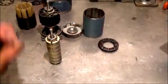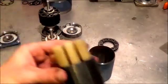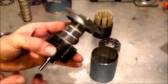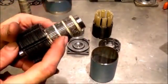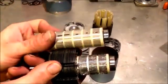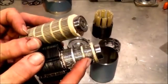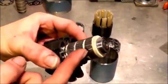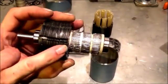So you'll have an outer case, a stack of laminates, and a rotor ready to go. I've already got halfway complete here — I'll pull the cap off the end and I've chiseled out all that epoxy out of those teeth right there. You can see how shiny it is all the way through. You're going to chisel out all that epoxy all the way through, making sure to expose all your little teeth, because those teeth are going to be your vortex grab rotor, each one slightly staggered so it follows the vortex pattern.